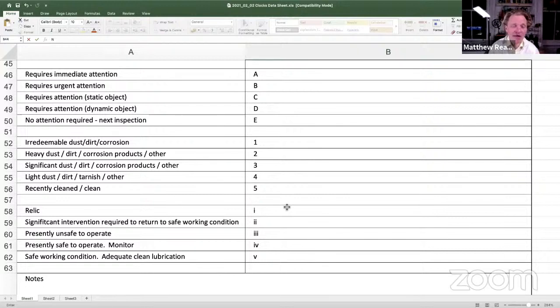But just before we went live today, somebody posted a picture of a long case clock center wheel back pivot, which had deteriorated due to breakdown or deterioration of lubrication. So if you see that, you can just stop the clock, it's fine. It can wait there until we're ready to carry out some treatment. It's not going to be deteriorating even more. But it requires immediate attention because the answer is dead simple.